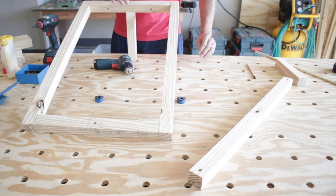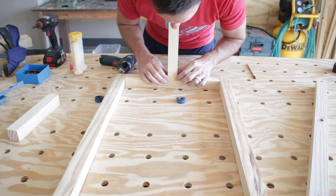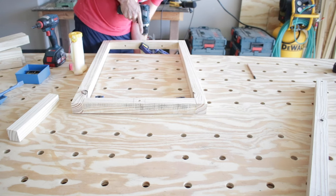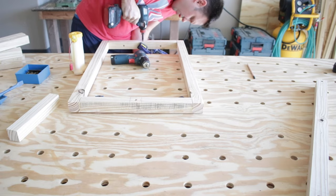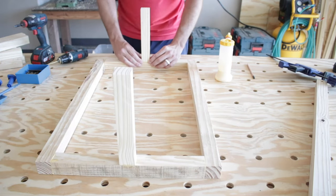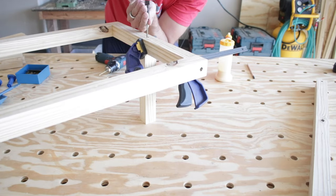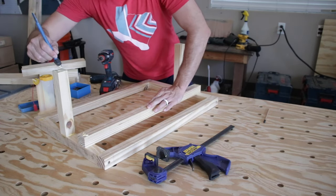Once the rectangle is complete, you can attach the perpendicular side of the table base — here's a quick dry fit of how it looks. After I glued all the pieces, I flipped it over to make it a little bit easier to align, then grabbed a clamp to hold it into position so I could turn it back over and screw it from the top down to make sure my hole was straight. I was careful as I went down so my piece wouldn't fall, but the clamp held it together really nicely. For the other side, it was just a matter of gluing it up and flipping it over on its end to drill the pilot hole and screw the fastener in. Then you flip it over on its back to assemble the last leg piece.